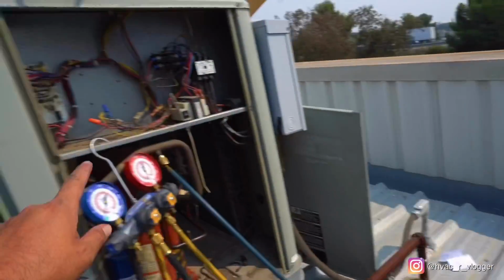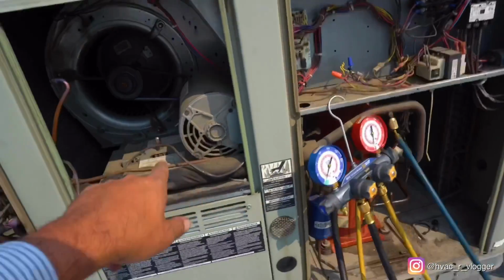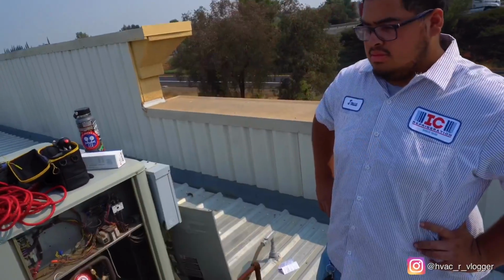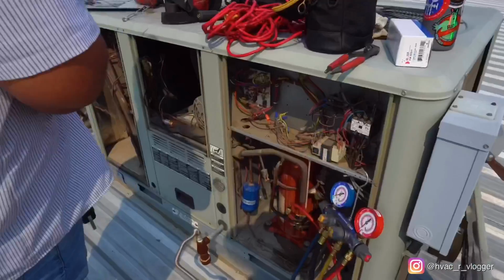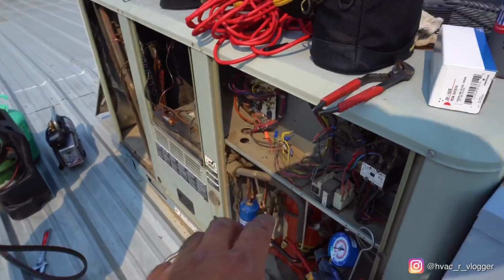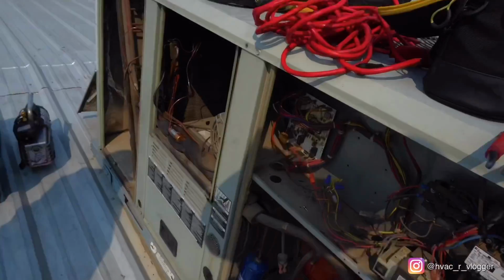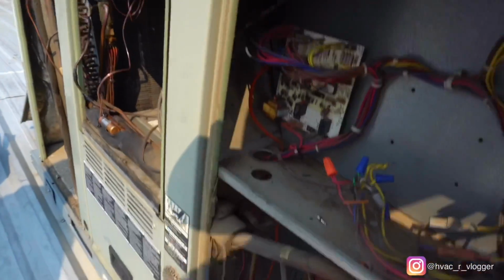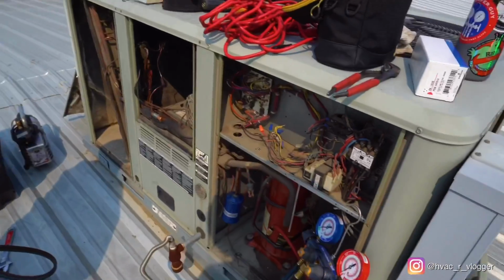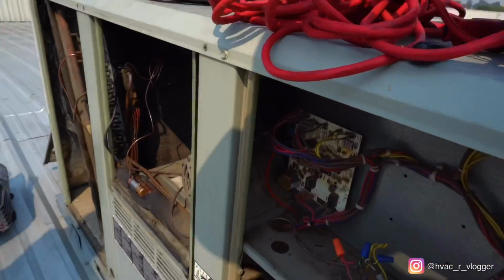Now we're flowing nitrogen through the system. So when you're brazing, you don't get that black residue on the copper and clog up the TXVs. So just a quick tip, bro. Anytime you're replacing filter dryers, since you're new, I always like to mark down the arrow. You see the arrow? Yeah. I always mark it down where it's going. Especially because when you're new, sometimes you forget. But that's something I always like to do, just mark them down.